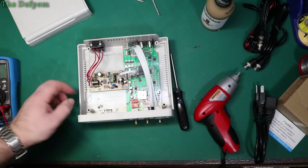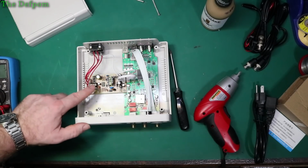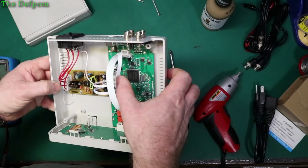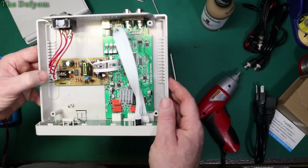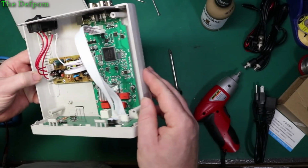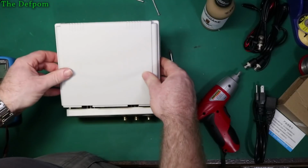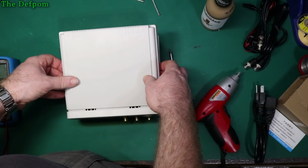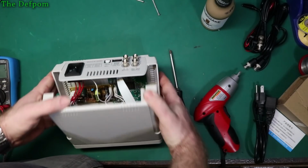So also you've got a little transformer down here, which is dropping down actually. That's what you're using, a little transformer, not a capacitor. Yeah, it's got the USB port and the TTL input there, which is obviously linked up to this chip here, whatever that is, going to the FPGA. I think it's quite nice. I reckon it's worth buying. It's got obviously some firmware glitches in there. But as it's USB, it might be possible to upgrade the firmware in it anyway.